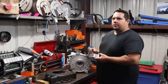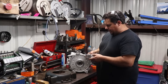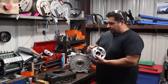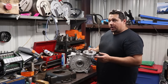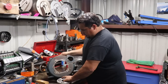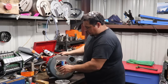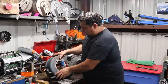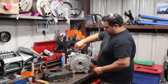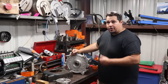Now I'm going to cut out a half-inch thick aluminum plate, about 14 by 14 inches, drill a hole right in the center, and take it to the lathe to get it centered. Once centered, I'll machine it to match this diameter exactly. From there I can put the plate onto the adapter and transfer punch all the holes — including the dowel pin holes — perfectly into the plate, since it's held centered the whole time. Then I'll transfer the engine-side holes as well.